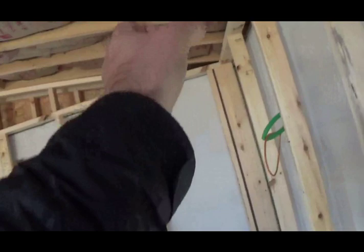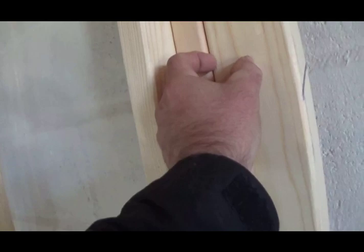And I know with the new style of framing, they look down on that because it's a big chunk of wood right there in your corners. You can't insulate. It's more about insulating and moisture control these days than structural support. But before, if we're at a corner, it would be three solid studs.